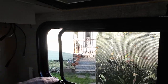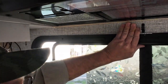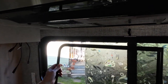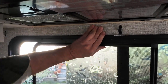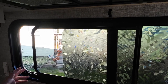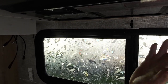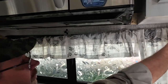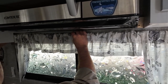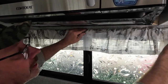Slide the screen over so you're out of this radius, then find which side the spring is on — okay, there it is. Now this one you really have to push on it, but as you see it does come out. It has the same springs. To put it back in, push up — I'm actually helping with my thumb to get it started — but once you get it started it falls into place. Close that, make sure you're in the groove, close your window, and put Becky's beautiful curtains back up.